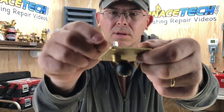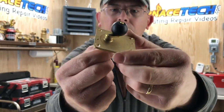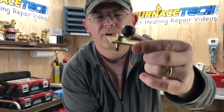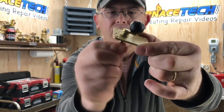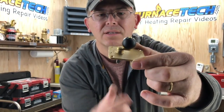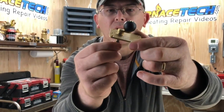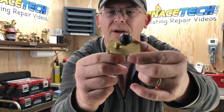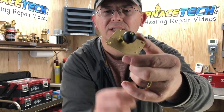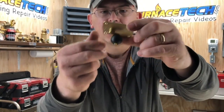If I rotate this little valve stem, you can see the little plunger move back and forth. It's very important that this valve is free and easy to rotate. What ends up happening is these zone valves start to get seized up, and then the motor is not strong enough to rotate it — so it never opens fully, the end switch never makes, and it doesn't tell the boiler to run.